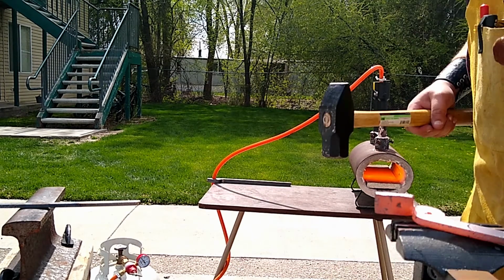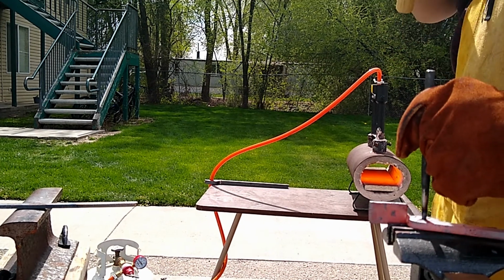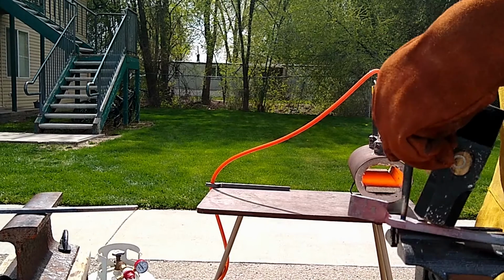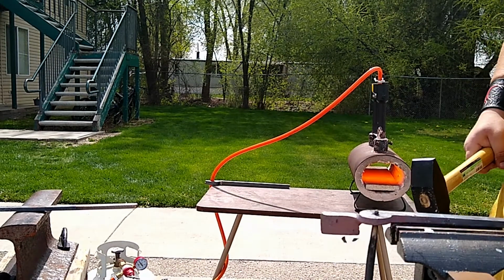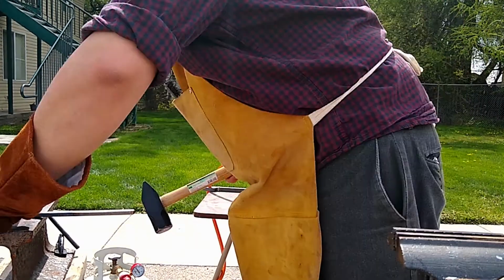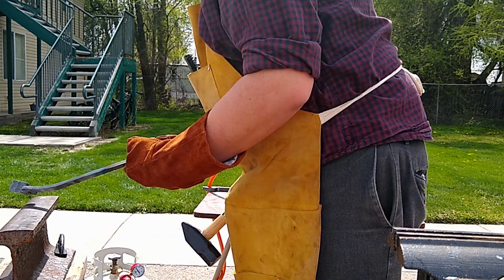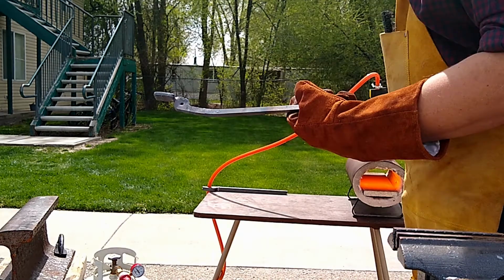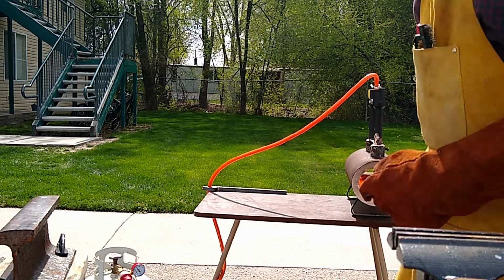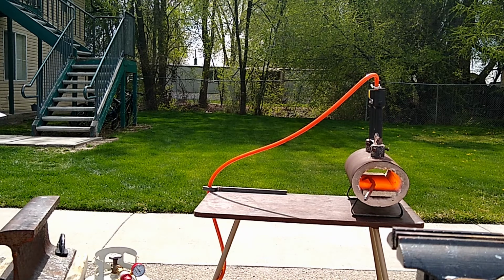You do that, and then on top of that, you need to make sure you have the right drill bit. All the ones at the hardware store say they go through wood, metal, and masonry, at least in the general use bits. And you should know that's a lie. By metal, they mean aluminum, not steel that's 5/8 of an inch thick. You can drill that hole. But it'll be the last time you use that specific drill bit, and I don't feel like replacing them every single time I do it. Especially since a 5/16 bit is, well, not really expensive, but if you're buying a new one every time you drill a hole, not cheap.